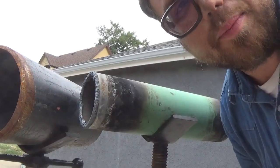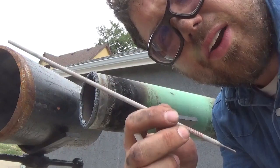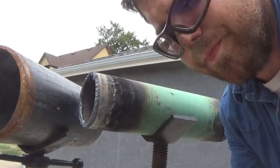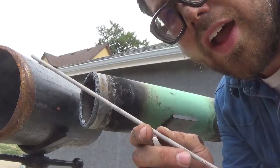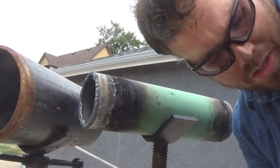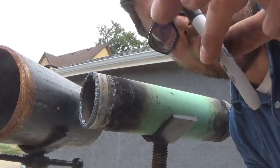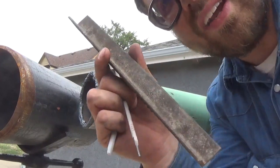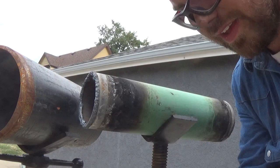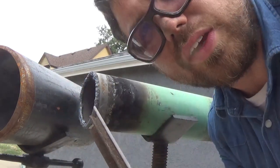You're going to need a couple of things: soapstone, a rod — a TIG rod or a 6010 rod. This is 3/32; I would recommend that. 1/8 6010 will work just fine. I'm going to use a Sharpie today. And a piece of angle — bigger than this one. Ideally it's almost as long as a rod; that should work pretty good.